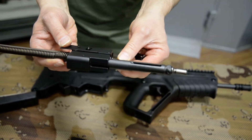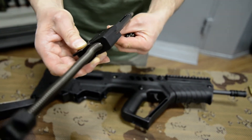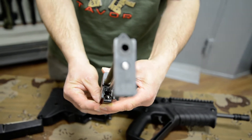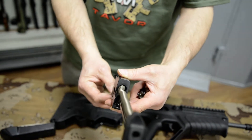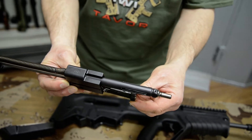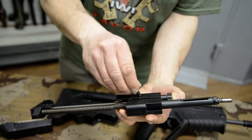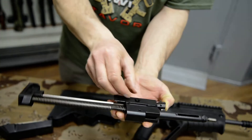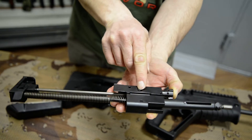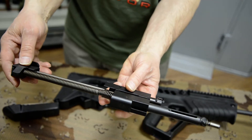So we'll reassemble it. One thing to remember is you have two flanges on the firing pin — they fit so that one flange is inside and one flange is outside the carrier wall. With the firing pin in its place, the bolt is inserted. It's a right-hand bolt, so the extractor goes to the right. The cam pin is returned to its place. There's a flat on the pin, on the flange — it goes to the rear because the hole in the pocket is set to the rear of the pocket. That way it stays in line and does its job the way it's supposed to.